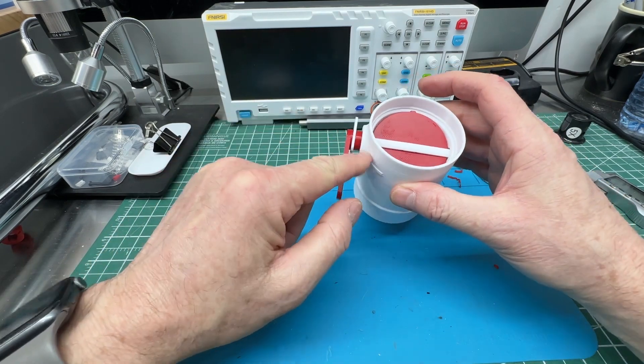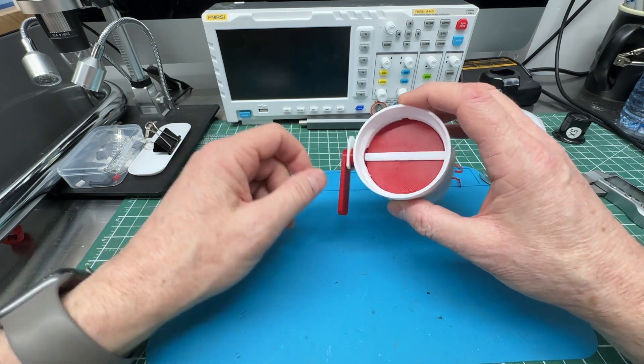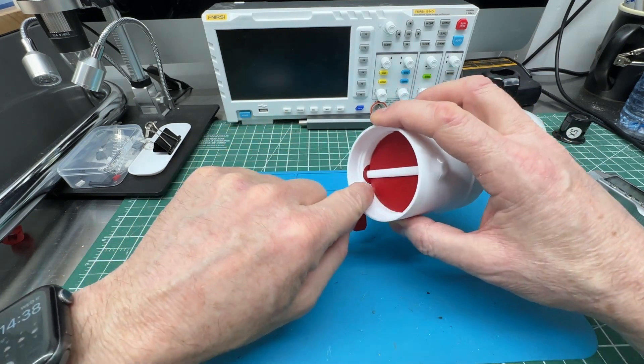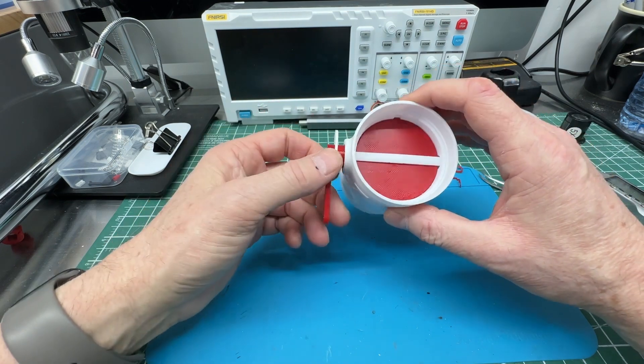You can preassemble the handle and even put the clip in and the o-ring on so you don't forget. Then put the handle in — but not all the way — insert the valve plate with the notch on top, wiggle it in until the shaft ends seat into the recess on the opposite side and the notches meet the protrusions on the valve plate. Work it a little and you'll feel it go free — that's when the o-ring pops into the mating slot on the body. The red part of the handle inside should be flush with the inside of the valve body.